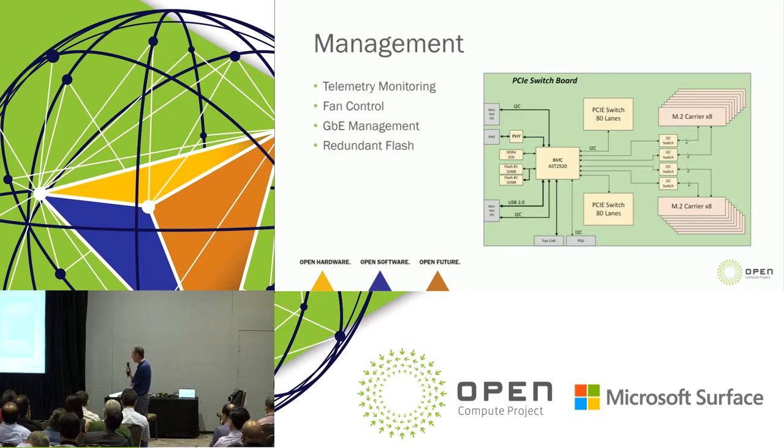So when the base boots up, it can go off and find out that there's an expansion box above it. It can then look and see what its boot status is. Not booted yet? Okay, I'll just wait until that is booted, because you don't want to release PCI reset until it is. So there are some pitfalls with expansion that the cable infrastructure provided by Lightning lets you overcome in an elegant fashion.